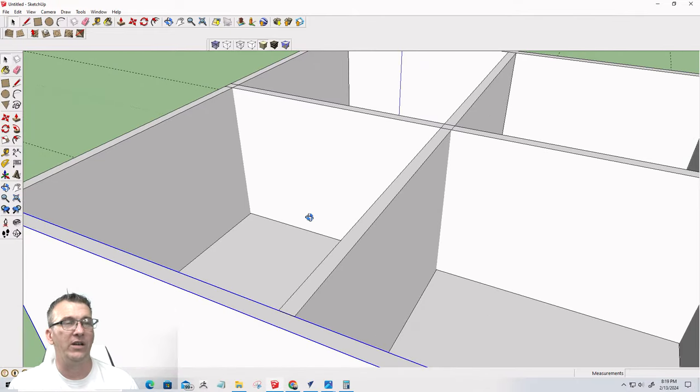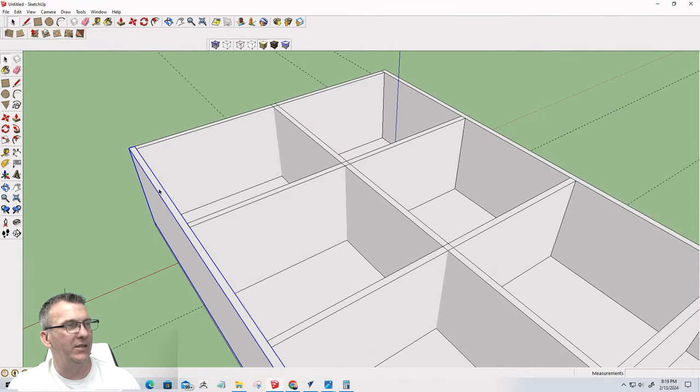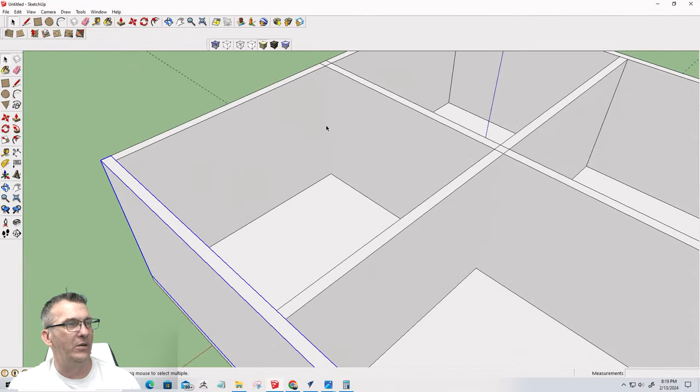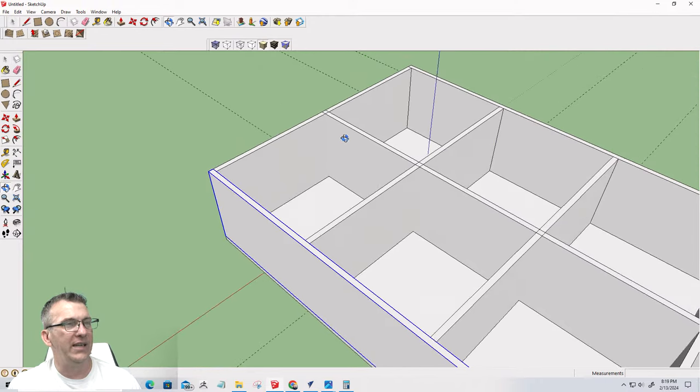For those of you that are woodworkers, you know, but for those that aren't and are just learning, trying to get familiar with terminology: a dado goes across the grain, a groove goes with the grain. And on your edge, that's typically referred to as a rabbet, R-A-B-B-E-T, not the fuzzy little fluffy animal, but the joint. So we're going to be creating a dado down this panel for this end piece to fit into.